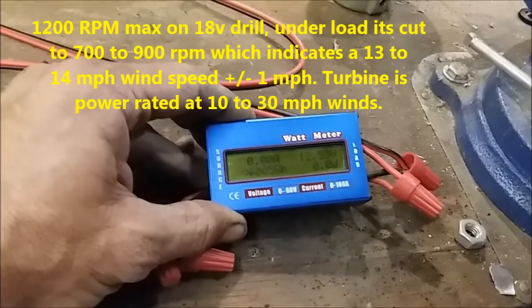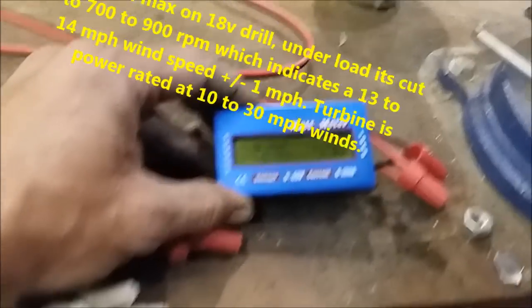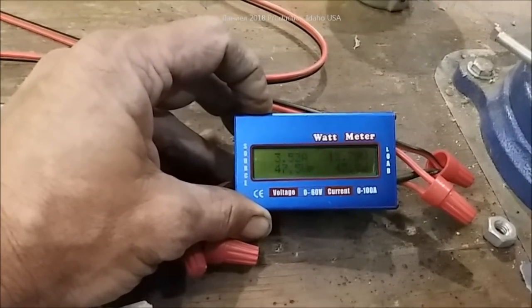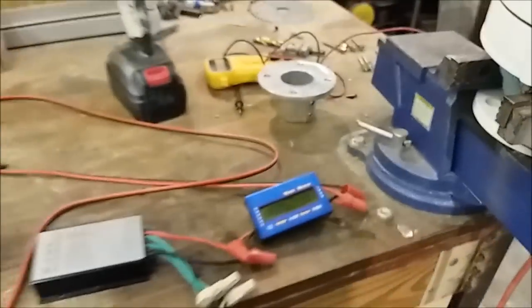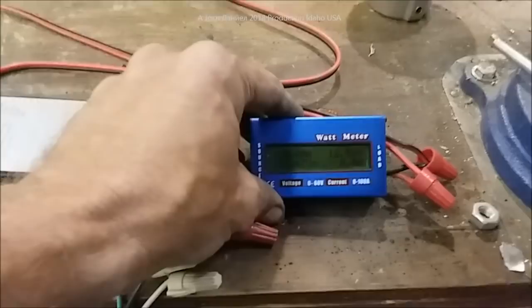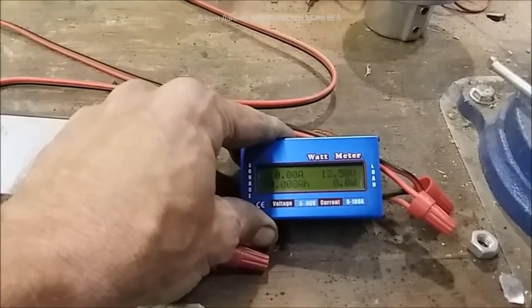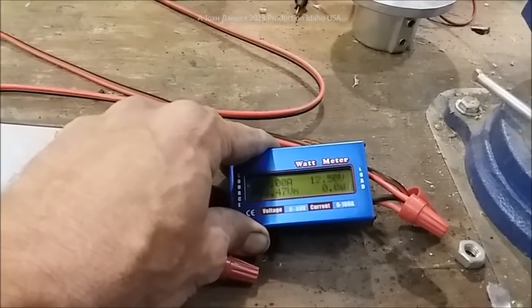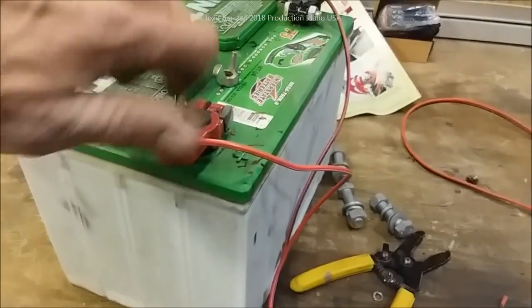So we have 12.79 — it jumped up to that, and I believe that was right at almost 50 watts. So three and a half, about 3.5 to 3.6 amps — now that's under a load. The wiring's a little bit light gauge; she picked 16 to go onto this, this is 12 on this one and 16 here, this is 14 going into 16, so that didn't help. But it's showing the output, and it raised it up — from 12.47 up to 12.5, it peaked at almost 12.8. This is, like I said, it's an old battery but it's still a good battery.